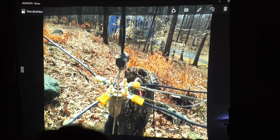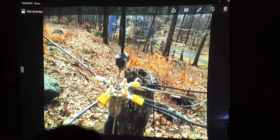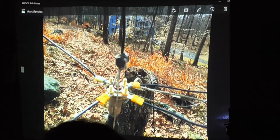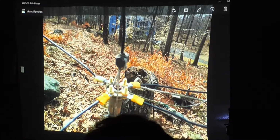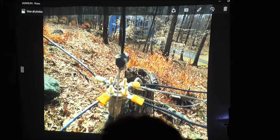However, there is a difference in the actual resonant frequencies and the adjustments you have to make in the lengths of elements. PVC coated wire will make the resonant frequency 2 to 3% lower, which is important, but it's not uniform. You have to use some trial and error. The first Foursquare I put up with this stuff was wildly not where I thought it was, and at that time nobody was using jacketed stuff. So I experimented, then did some research, and it was about 2 to 3%. So I had to back that into the calculation, and it's a minor thing.